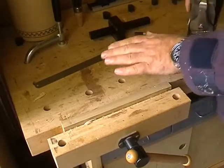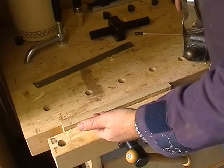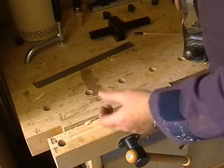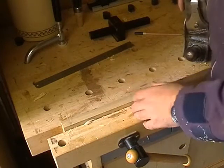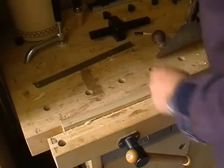What's happened is I've taken the wood down to the groove made by the marking gauge. Remember, the point of the marking gauge made the groove inwards, so I've still got less than a millimetre to go. So: one, two, three strokes — and I've stopped there.